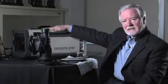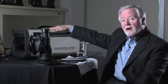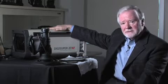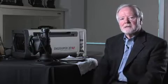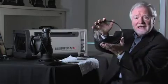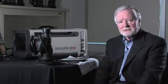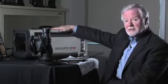For a studio box lens like this — this is a top of the line high definition lens — the central design priority is the highest HD performance possible. To do that, the optical designers will resort to every optical technology that they know. No holds barred, they go all out. They start with large optics; the input glass is this size on a lens like this — that's sensitivity. After that, it's many, many elements, up to three dozen in a lens like this. Every element gives them a new design freedom to fight aberrations and optimize the many parameters that contribute to the final aesthetic of the image. As a consequence, you end up with a large, heavy lens.